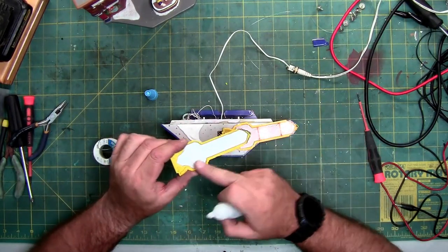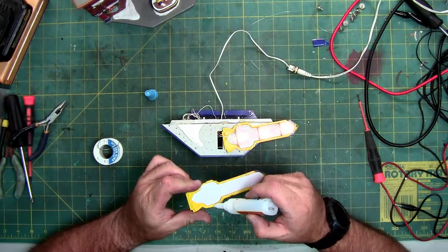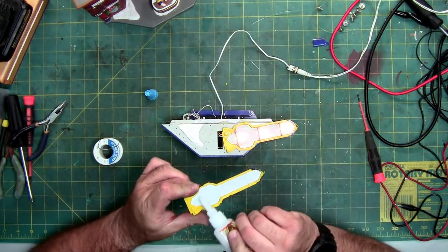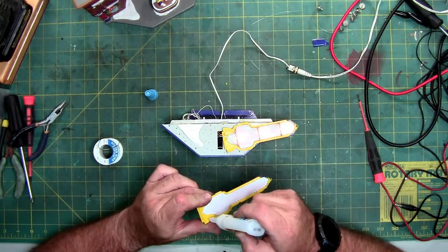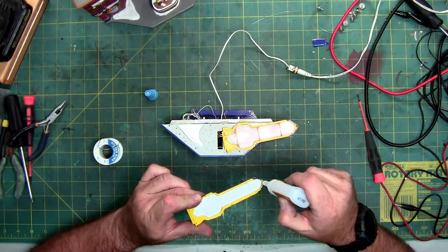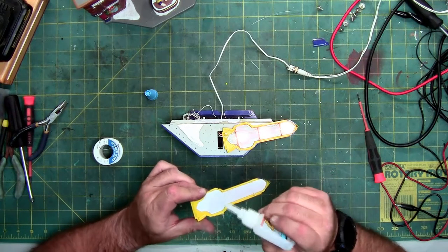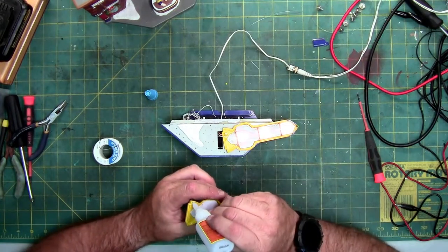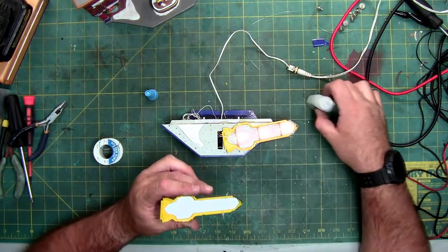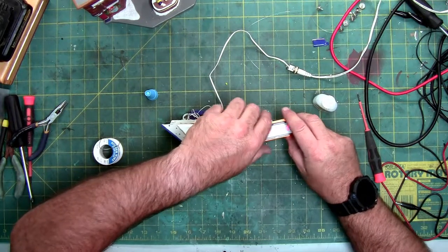This side is the female side. That's the male side, meaning the ridge goes inside here. So I am just going to put a very thin layer of super glue on the inside, or basically where they had it. They don't have it all the way around. There's gaps. So I'm just going to put an itty bitty amount in the areas that they had it, which there's a lot going up the side here, right there. And there, and there. And here, and here. So about 80% of the whole thing has got glue. That's probably why I was able to split it with my fingernail.